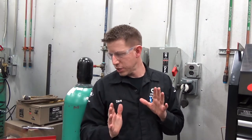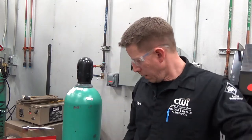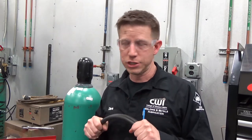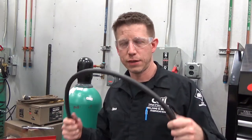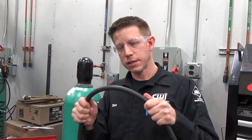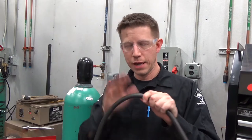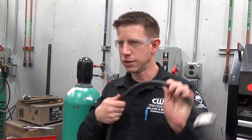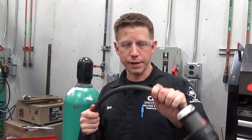When doing any kind of wire change-out or maintenance on these machines, keep the source shut down and unplugged. When you come onto your shift, you want to make sure your equipment is in tip-top, safe working order. Start at the power cord — from the machine, work your way down to the plug — and look at the sheathing on the power cord. Look for any slices through this protective layer exposing the power cable. Also make sure it hasn't been smashed, that no forklift has run over it, that nothing's crushed it, or that it hasn't been dragged over hot metal and started melting off, exposing those wires.